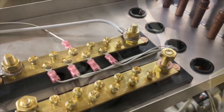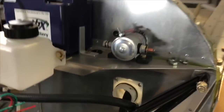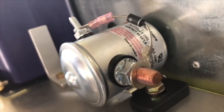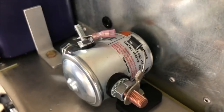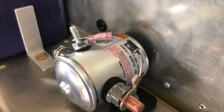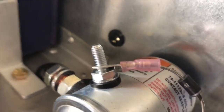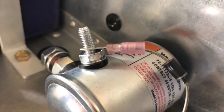Next, make up your diode assemblies. Crimp up a large terminal to one side and a small one to the other side. It goes between one on each contactor — just stick those on there. Don't put the hardware on yet. The stripe on the diode goes towards the battery terminal, which is marked right there — B for battery, or BAT. Stick those on there and just leave everything loose for right now. You might want to solder these — it's a hard metal-to-metal contact. If you don't feel like you're getting a good crimp, we have a tool that does a good job. But if you are uncertain, then just use non-insulated terminals and solder.